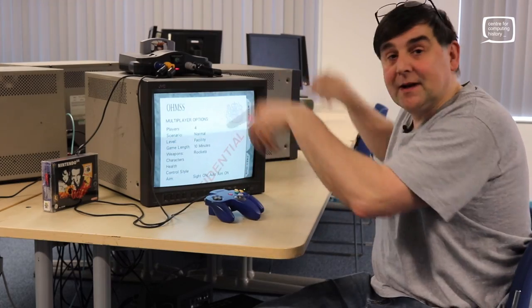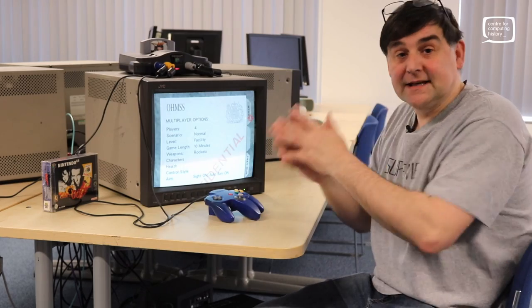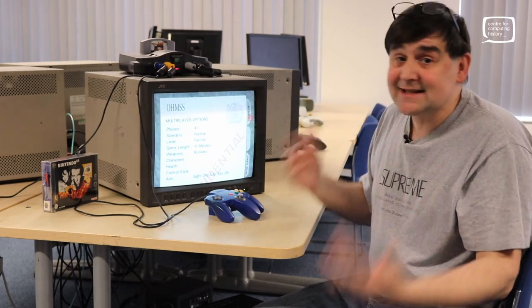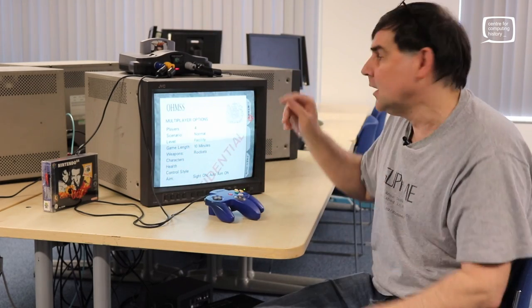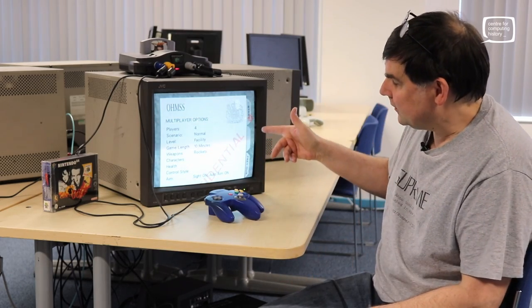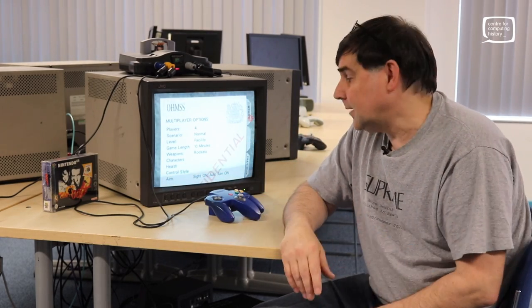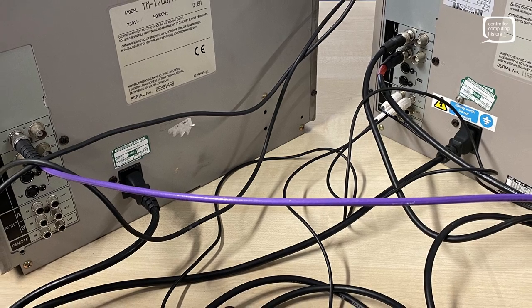As well as the video being split, we've also split the sound, so each screen is fed with sound coming straight at you. Obviously it's the same sound for all the screens — there's no way of getting your own sound for your particular player; you can't just hear their gun. The sound goes through a standard distribution amplifier and feeds into each screen individually.